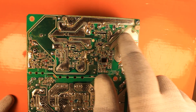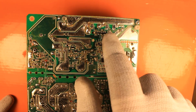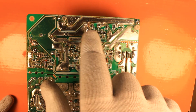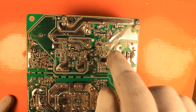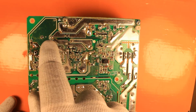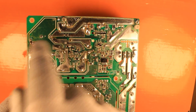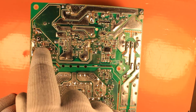Then we are going into the second common mode choke, and from there we are going into the two field effect transistors, which are working through this relatively large inductor coil to provide an active power factor correction. And then finally right here we have this TEAPO, or however you pronounce it, bulk capacitor. Then this here is the plus 5 volt standby.